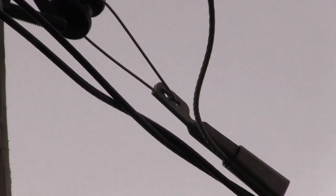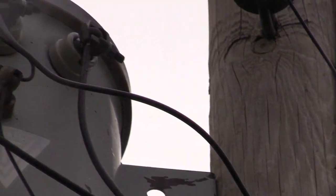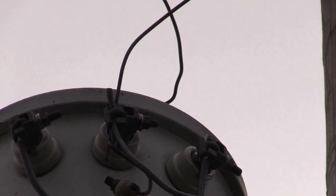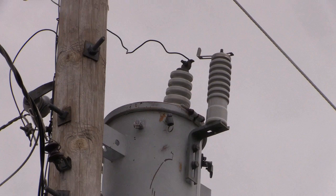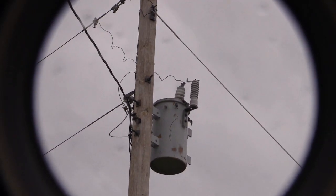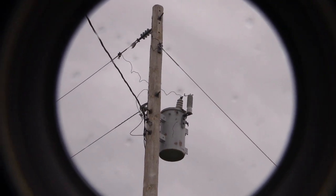You can't see where the hot wire goes in this view — we'll get to that in a minute. Down at the bottom of the can is an additional ground connection. All of the pole grounds are tied together, and you can see that one of them goes to the guy wire that holds the wires going to the house. This wire becomes the neutral wire to the panel.